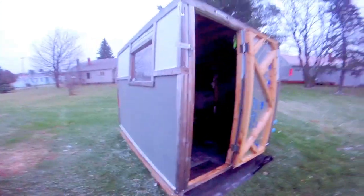Everything's made out of cedar. Two-inch insulation on the ceiling and floor, one inch on all the walls. Got a two by six here, then two by two and two by three framing. Walls are all two by two except for the center supports, and where my chair is I've got two by fours for my bench. Really light for how big it is — most guys' shacks weigh a ton. That's the inside of the shack — if you've got any questions let me know.